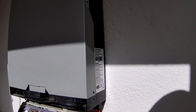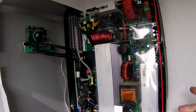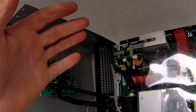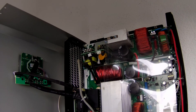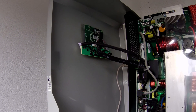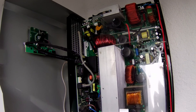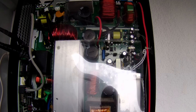I've already had this cover off but I've put some screws loosely back in. I'm going to take this top cover off again and open it up to have a look inside. Three screws down each side and two on top. I've taken the screws out, turned the panel around, and inserted one screw back in the top just to hold it out of place. I always try to avoid disconnecting anything I don't have to - you could damage the connectors, and certain components may need to be reprogrammed if disconnected. If you don't need to do it, why risk it? Now I'll admit half this stuff in there I don't know what it is, but the bottom line is I don't need to.